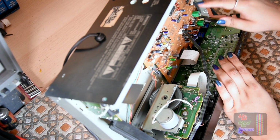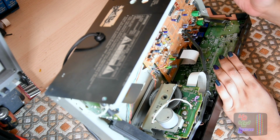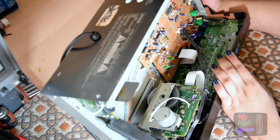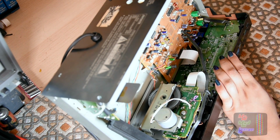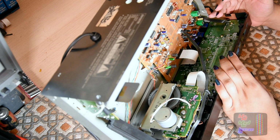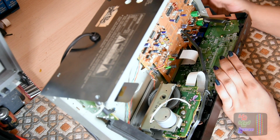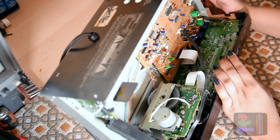If I'm correct, that's a Hitachi one. I used a Sony one in mine, but it's the same thing really. It's a Dolby chip. Actually, this one here too. HA1240. It's 2 Dolby. Okay, yeah, of course. Really? Why does it need 2 Dolby chips? Maybe one for record. No, but that's on the same chip. Excuse me while I talk to myself.